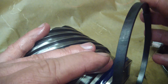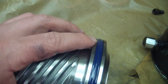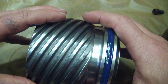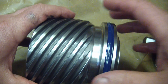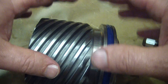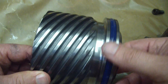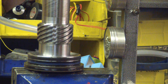This plastic wear ring — you can see it was fairly heavily contaminated. See all this scoring in the plastic. Normally when you're in here you'd replace the seals. However, this isn't really a critical seal — you don't need it to seal, because this is self-locking when there's no pressure on it. This thing cannot turn. It's like a worm-and-wheel gearbox: if you turn the worm, you can get the wheel to turn, but if you turn the wheel, the worm will not turn — it locks. And there was hydraulic oil bathing this whole area, so a little bit of bypass flow is not a big deal unless you get a lot. I'm comfortable putting this back together. For 10 grand, I'd have thought there'd be more titanium nitride and magic pixies.